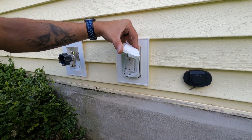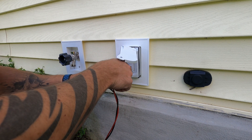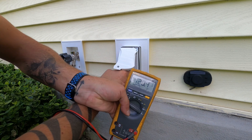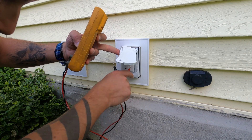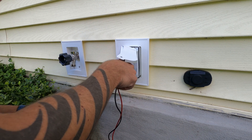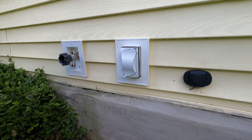We've got a green light on the GFCI — it's working. Note that this is a tamper-resistant receptacle, so when you put your meter leads in, you have to push both in at the same time, otherwise they won't push in at all. We're reading 120 volts. We'll check the small opening, which is your hot, and then check to the ground — also 120 volts. We're good to go.